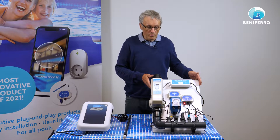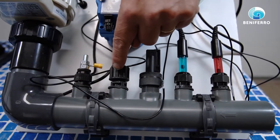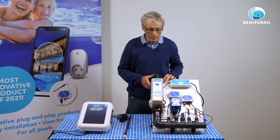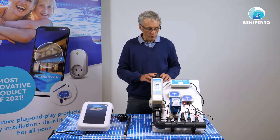The unit is all mounted on a plate, including the dosing tube for the acid, the flow switch, electrodes, and earthing — everything is already in place. So as a customer you only need to make the connection here and here and install the system.